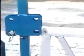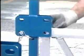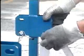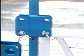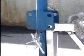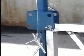Begin by placing one end of a side panel into the square opening of a connecting frame. The lip of the side panel must point inwards to support the floor. Follow this particular procedure with all Skyclimber MKD products. Push each side panel top into the corresponding connecting frame ear. Retain the top of the panel with the tethered connecting pins attached to the frame.